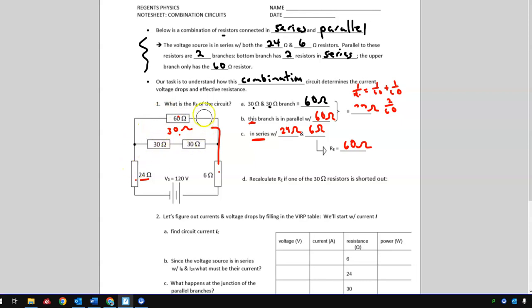I chose values to make them nice and even, but there's no inherent connection between the overall 60 ohms and the individual 60-ohm resistor. Now let's consider a variation: one of the 30-ohm resistors is shorted out, meaning its resistance becomes zero. So now instead of two 30-ohm resistors in series in the lower branch, we have a 30-ohm resistor in parallel with the 60-ohm upper branch.